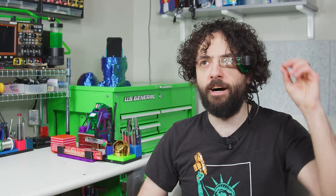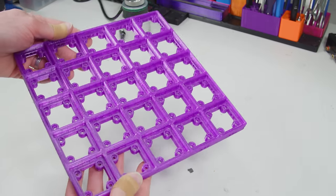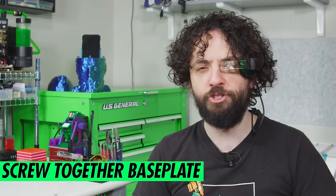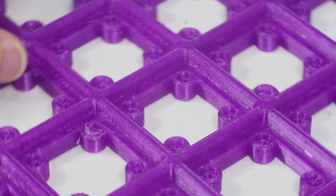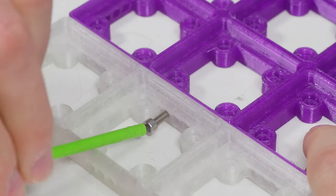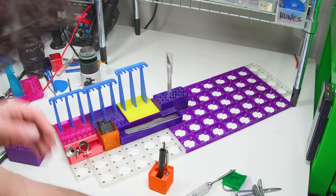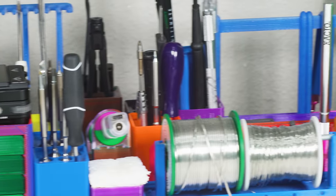The worst part is that I didn't think to add a way to attach plates together, which presents a big problem for people with small printers. Kyle Warren went back to the drawing board and created the screw-together base plate. This design keeps the mounting holes, magnet slots, and rigidity of my design, but ditches the weights, the feet, and most of the bulk. Most importantly, Kyle added holes around the perimeter to tightly bolt or pin adjacent plates together. Sized for American 4-40 screws, though I used M3 hardware, and it immediately became the foundation of my daily driver workbench setup.